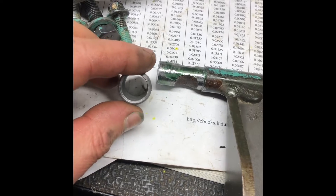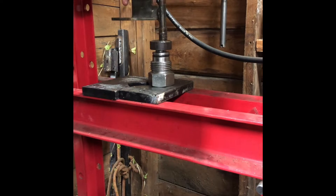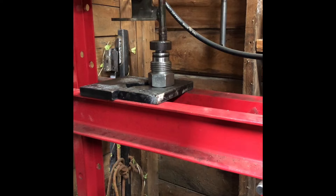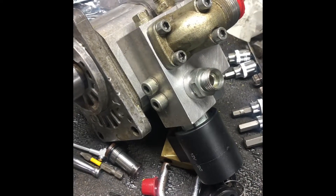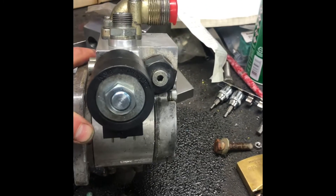We undersized the bushing so we can press it onto the shaft and repair it. This unit came with a centrifugal clutch and we're transferring it over to electrical solenoid-operated. We're relieving some of the ports - I had it on the lathe trying to make it look like the newer style manifold from the newer machine. I was able to do it with some parts from Princess Auto, keeping the relief valve standard. We're going to test it out and see if it works.